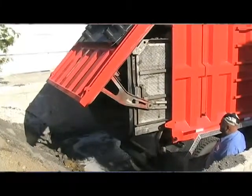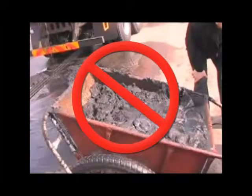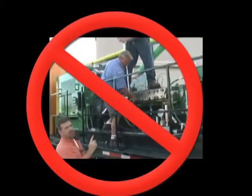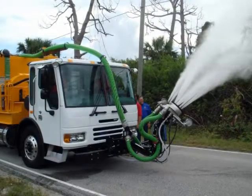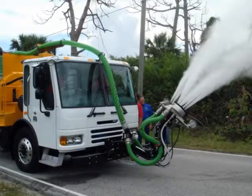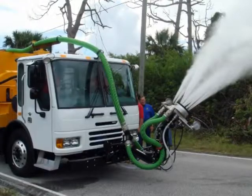How about our dewatering and easy dumping system? There's no sludge, no mess. What about the fact that our blasting pump requires no torque wrench whatsoever? It's so simple, so easy. Even you can use it. About the fact that our nozzles are very easy to check, even from the driver's cabin. Just pull the heads up, turn them around, stop your rotation, and immediately inspect whether your jets are sharp or whether they're worn.